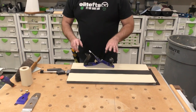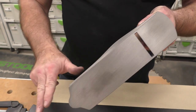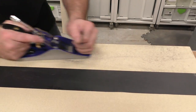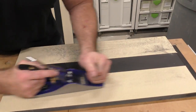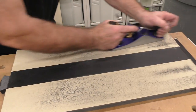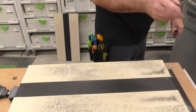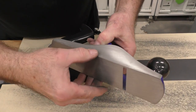I've put down 120 grit. The hardest part is grinding out your hollows first — that's where the 80 grit is aggressive and where you spend most time. With 120, I'm only removing those 80-grit scratch patterns — it's a very quick process, just back and forth. You're going to see a finer scratch pattern. My quick inspection — look at that sole; I've got a 120-grit scratch pattern.